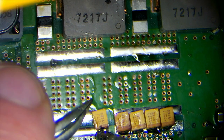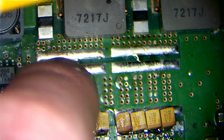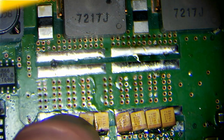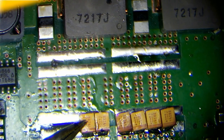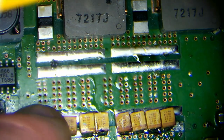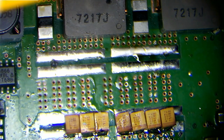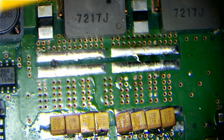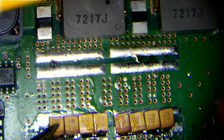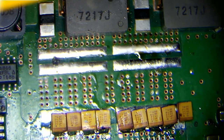And these are supposed to be 220 microfarad, 6.3 volts. The 6.3 volts gives us a bit of room. The original Tokin capacitors, I believe, are 2.5 volts for the Tokin 128. And the 128 just means that it has a 1200 microfarad capacitance on the original Tokins. So again, we just tack them in. Like so. Get one on the end here too.